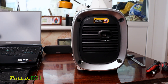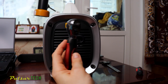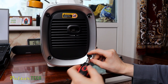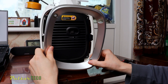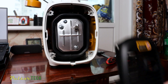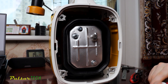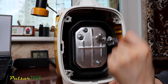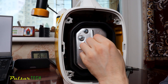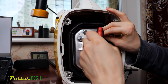Because I'm going to be using it indoors, I want to drive the fumes further out, so we need to remove the back plastic cover. There are four screws to remove — you can use a regular ratchet with an 8mm socket or a screwdriver with the 8mm socket. Unscrew all four screws, then take off the plastic cover. The back plastic grill is held by two latches on the sides — just pull it and it comes out very easily. I couldn't get a regular screwdriver to fit because it's a little recessed, so I used a ratchet with a socket instead. It's good to have short stubby tools for tight spots like this.